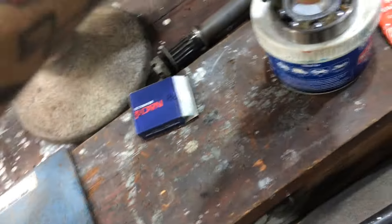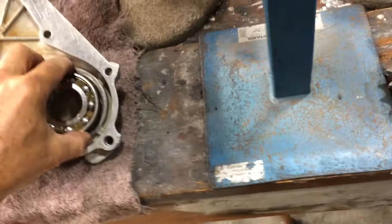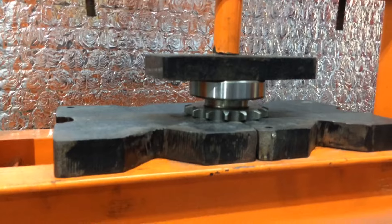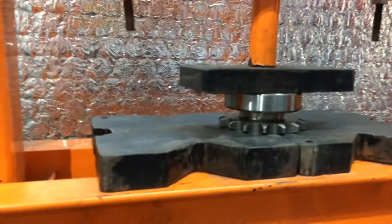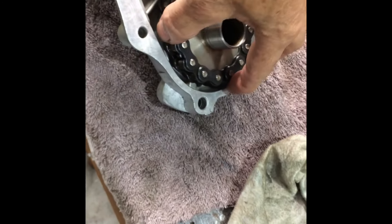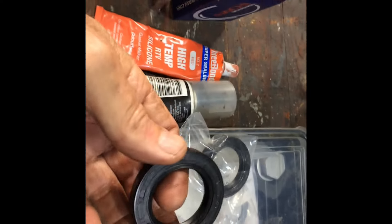I've cleaned all these surfaces. I'll heat that up and it should just drop in - it's a tight fit but heating it helps. Always put a bit of grease on the bearing surfaces, don't put them on dry. Because I heated it up it just fell straight in. Make sure you put the chain on first - you can't get that chain off otherwise. Now I'll put the bearing on the correct side - that bearing fits into there.